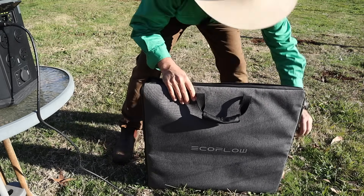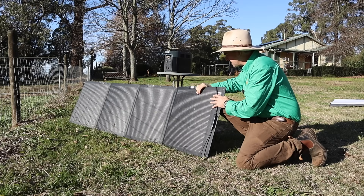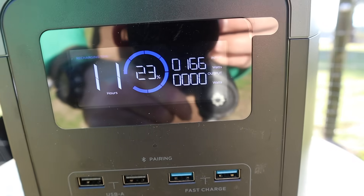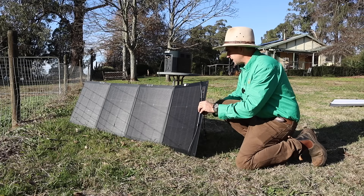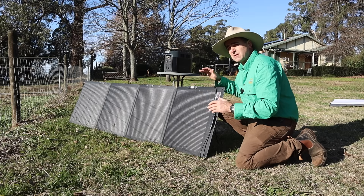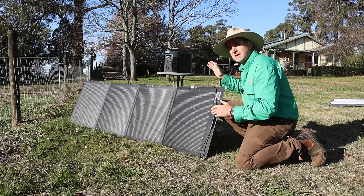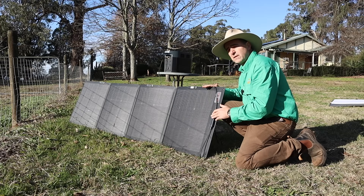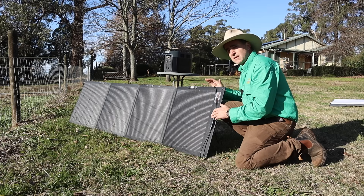How easy are the solar panels to use? They're slightly oblong so they only fit one way into the bag. The panels themselves are partially flexible and appear to have three or four bus bars per cell, so if you cover a cell they'll keep working. The stands on the back are supported by elastic bands, so if you try to move the panel the stands collapse and you have to re-stand the whole thing up again. There's no fixed stand position — good because you can adjust to any angle, but annoying every time they move or get blown by wind. There's an adapter cable to connect the power station to the panels, which comes included with the solar panels.